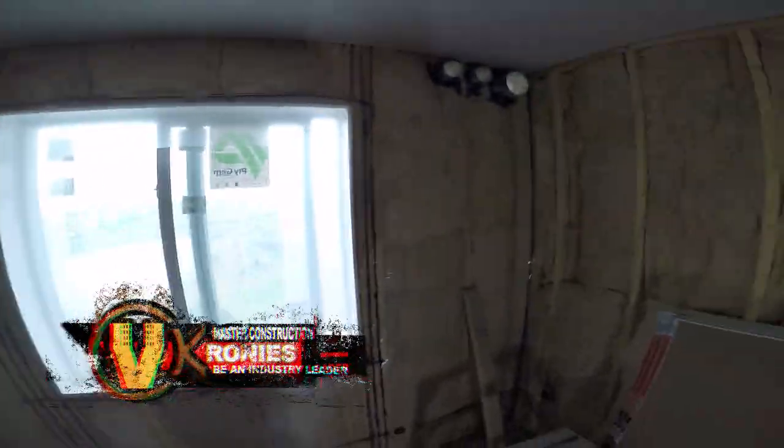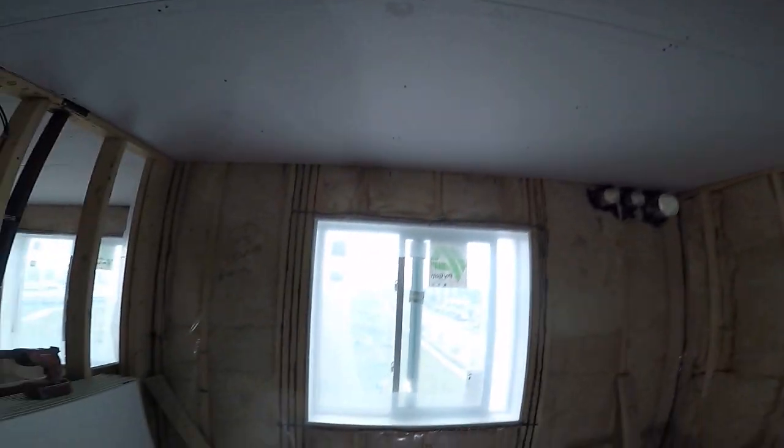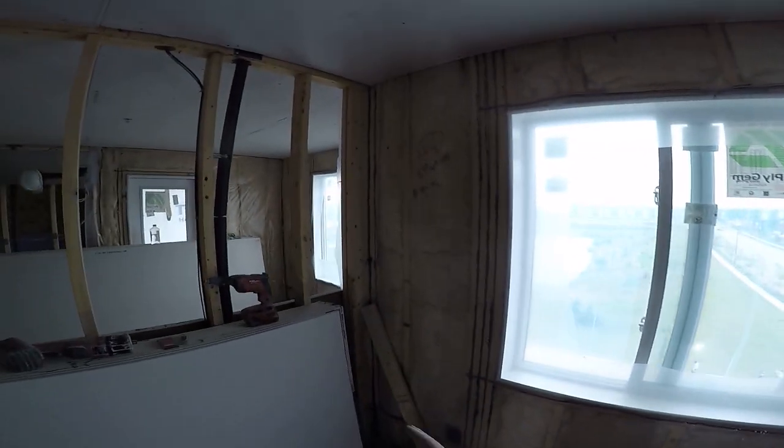There are two 10-foot sheets. You had to trim one a quarter inch off and a half inch off the other, but that's not the point. The point is, I'm going to be using the standard point bit to cut out the holes, and I'm going to use the quarter inch guide point for the window, all right? And I'm doing this by myself. So I have 2x4 cut so that I can set the top sheet on that, okay?